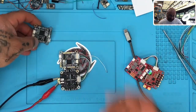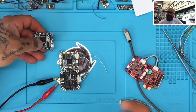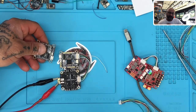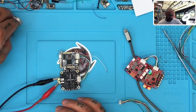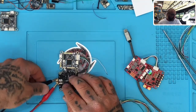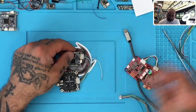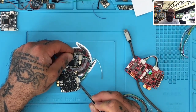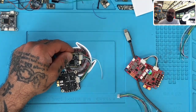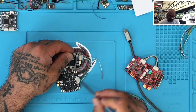What it actually does is it blew out the 3.3 volts, so I believe it damaged the processor — I've pulled everything out on here, tried to put in new step-downs, still not fixed. Lesson one: please make sure you do not just assume things are going to line up. If an ESC says no cable and the harness has a cable, don't think that cable is okay to use. Remove the cable, especially if you're going to try to do this.